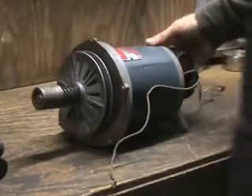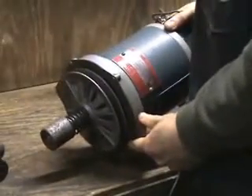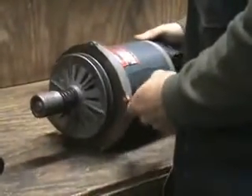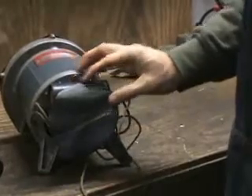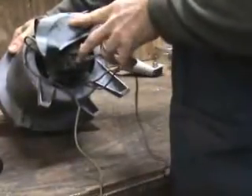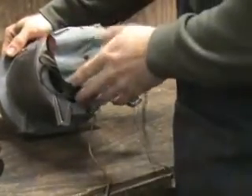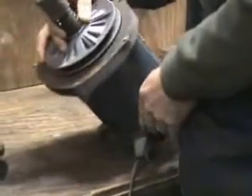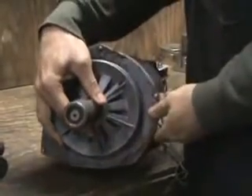This is the three-quarter horsepower GE motor used in the 50s along with the Franklin motor, but more of the Greenies had this three-quarter horsepower. It has a little shield on the back, an external capacitor, and an external little box with the starting relay inside. So it's pretty easy to work on. The front is the type with the larger shield around the spring.